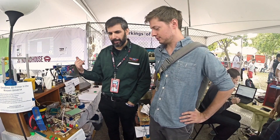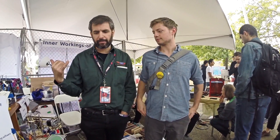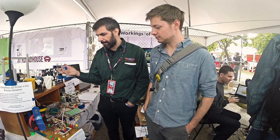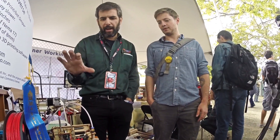A lot of you know what the Printer Bot Simple is by Brook Drum, and he has released the source to that, so I took the artwork. I noticed that there were 4mm bearings and rods that I could buy and NEMA 8 motors were available. So I collected parts and I printed and laser cut the artwork at 0.53 scale, because 0.5 was just not quite right for some things. And I put it together and started working out the problems.